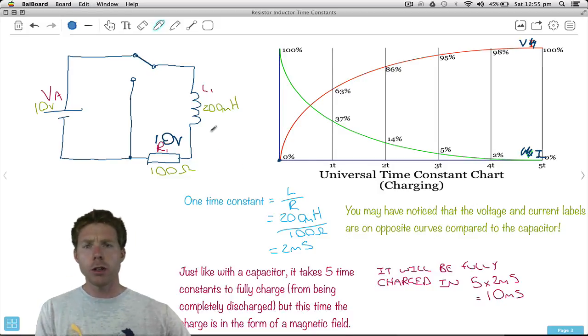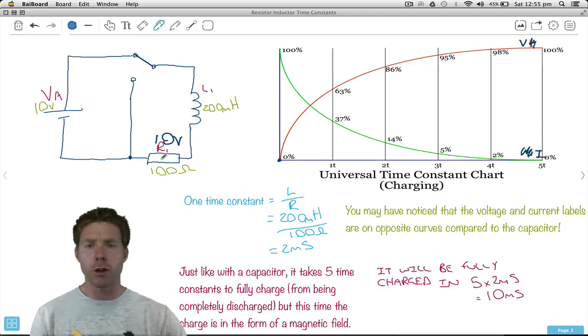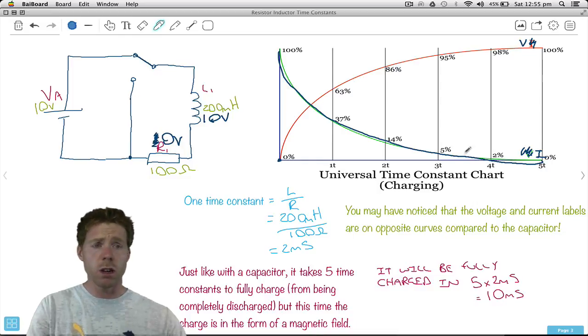As the capacitor charged, it takes away some of that 10 volts from the resistor. Therefore, we do the formula again, 9 volts divided by 100 ohms, you're now getting 90 milliamps, and it keeps going down. So the current keeps going down and down and down. And when the capacitor is fully charged at 10 volts, there is now 0 volts across the resistor and therefore 0 current.